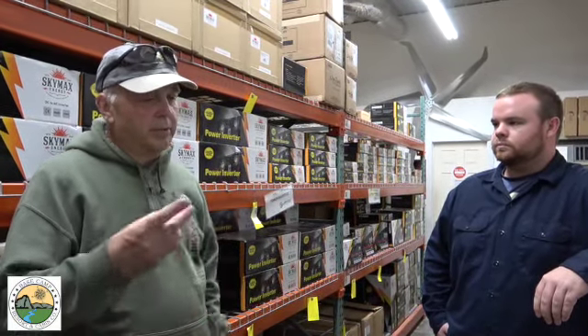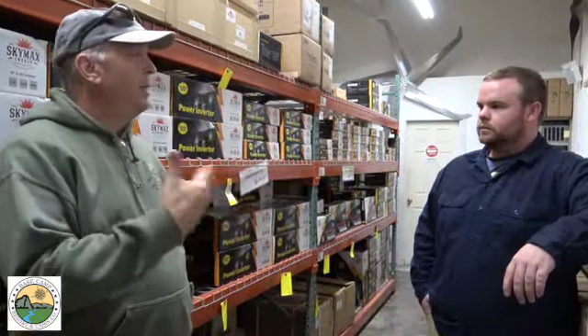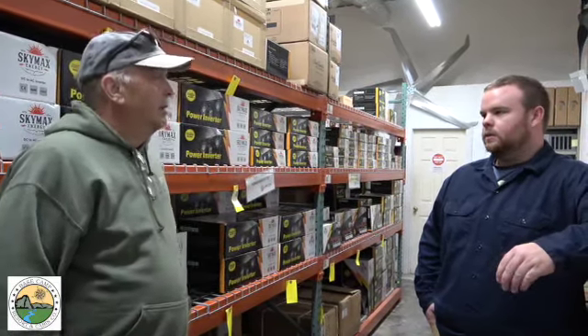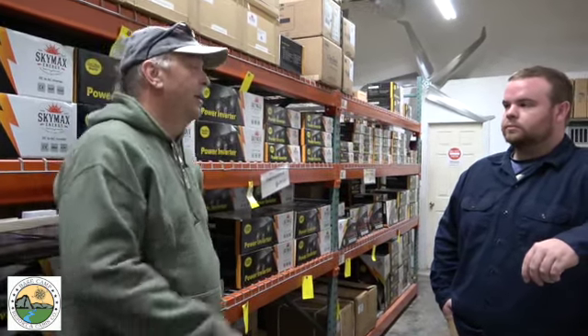It would be a small kitchen with TVs, computers, and lights — nothing like a water heater; that'll be gas. Cooking is going to be gas too — not doing anything 220-based. To help size the system properly, give me a list of exactly what you're going to be running. Keep in mind that internet can pull several watts an hour, so that's worth noting.